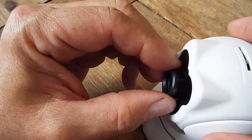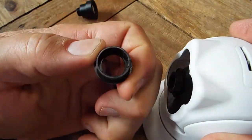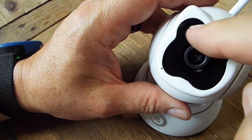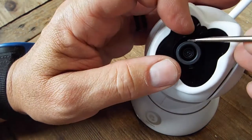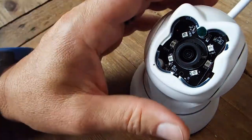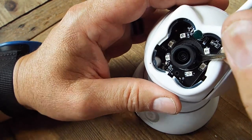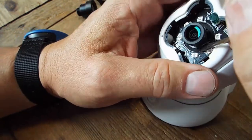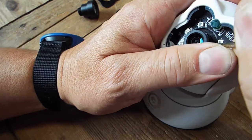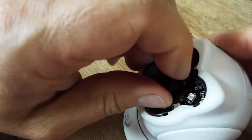The first thing is there's a little beauty ring you can twist off on the lens itself — you just twist it and it pops right off. The next thing you want to do is there's an infrared filter around the infrared light output on the front of the camera. You can pull that off with a flat blade screwdriver. Then right at the base of the lens there's a little strip of epoxy, and if you carefully scrape it you can just break the epoxy off.